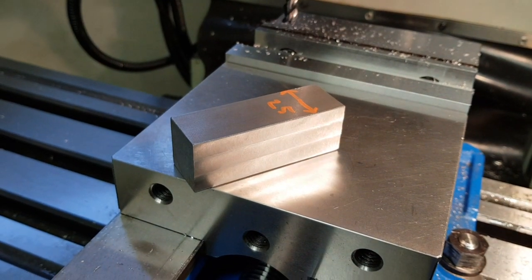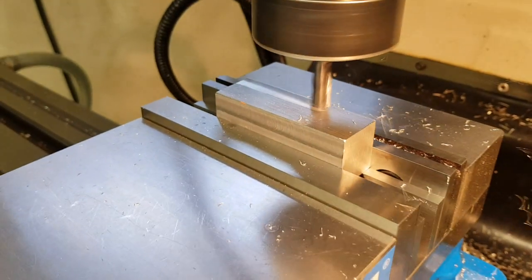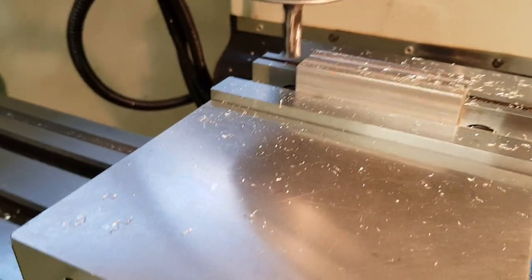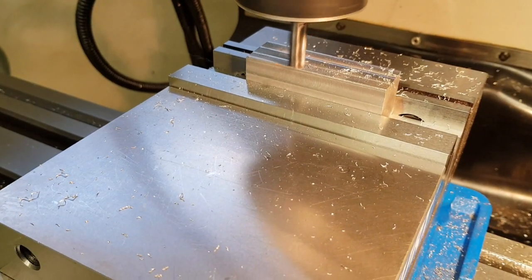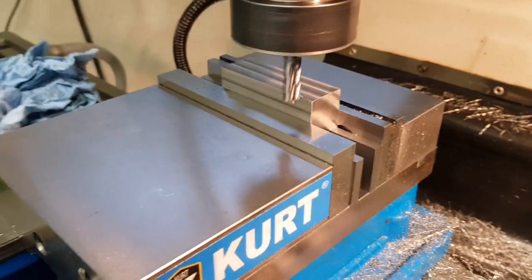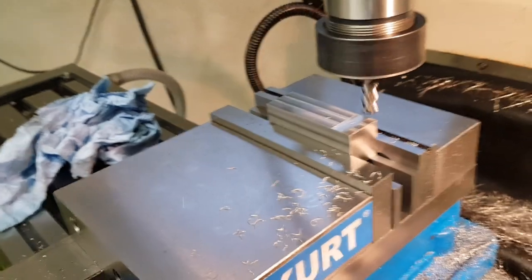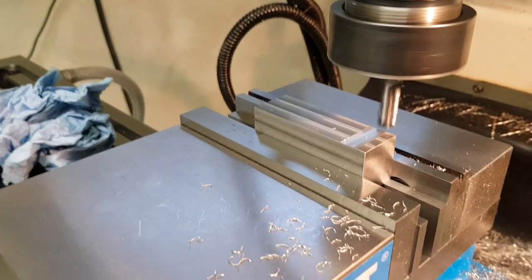Because the holders are 70mm deep. The location slot is going to be 35mm wide and about 1.5mm deep, so I'll just take a light cut here first, and then we'll take a bigger cut once we have established the right look of it.